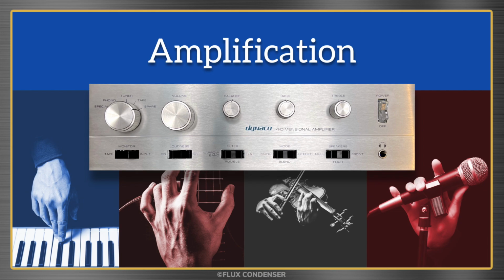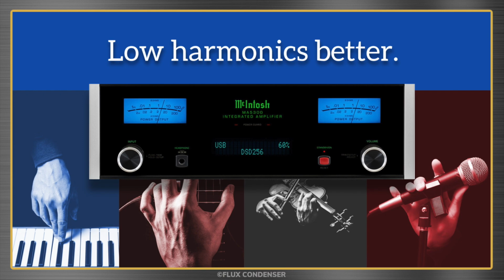Unfortunately, all audio equipment, no matter how good, adds harmonic distortion. Our SCA-80Q is a good performer, with harmonics mostly about 60 dBs below the signal, which makes those harmonics barely audible. Better equipment will have lower harmonic distortion, but the degree to which this makes an audible difference is really up for debate, as with everything in hi-fi.